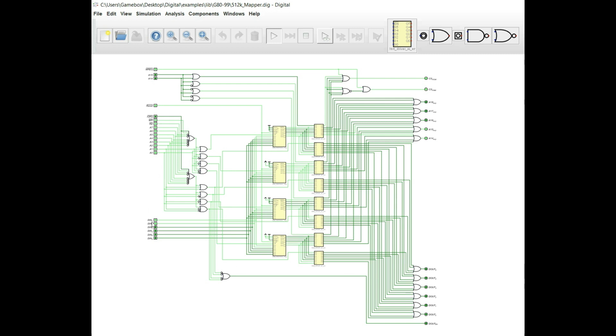So we've written all those bits, and if we go to check these with the address pins up here, you'll see the bottom window, A14 to A15. Go to the next, we got 1F. Go to the next one, we've got 3, and if we go to the very top window, we also have 3. So that's the way that it works.